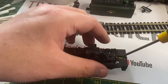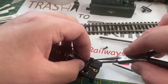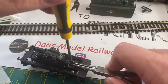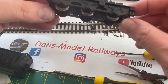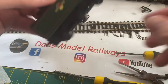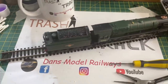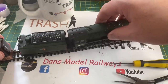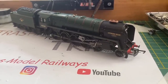It is worth noting: if you've got a Railroad 9F, just keep an eye on it — especially the earlier ones — because this tender is a real problem with mazak rot. I have had one before where I took the tender chassis apart and the whole thing just crumbled. Luckily, old Ringfield motor housings from older tender-drive models do fit, and I have fitted an older Ringfield chassis to my own tender. Now that that's all done and it's free-rolling, just making sure the pickups are in alignment — the body shell clips back on and is secured with one screw underneath where the coupling was. The coupling is then put back on, and giving this 9F a quick battery test now, I'm very pleased to see that it's been returned to service. Remember, when we first had this it wouldn't move at all. Just lifting the loco wheels off the track, with all the wheels off that proves that the tender pickups are working.